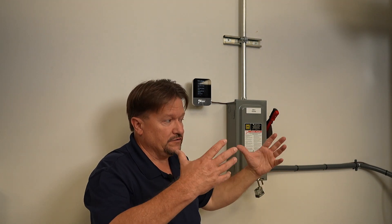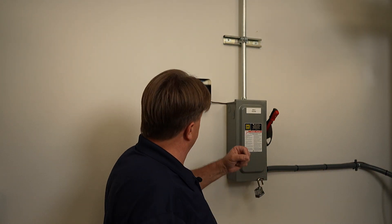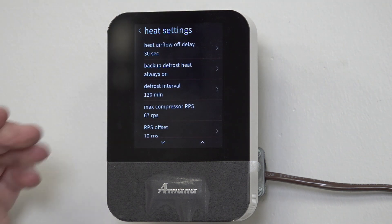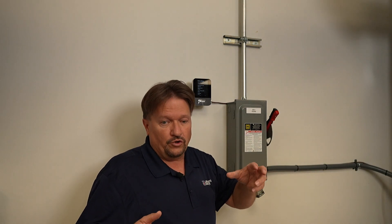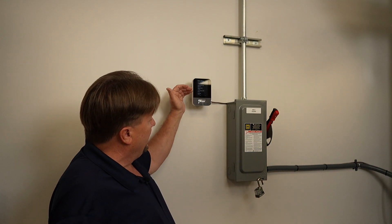I may hear some people say that's not the way you do it - you put it below a certain temperature. But 'always on' will save you - it will be always on. Now we're going to look at defrost interval. This unit, especially the side discharge units out there, has what they call intelligent defrost or smart defrost. What it does is it won't run a defrost unless it sees that it takes a certain length of time. When it takes above five minutes to defrost, it's going to shorten its defrost interval automatically without any input from you. So just leave this at whatever it's set at.